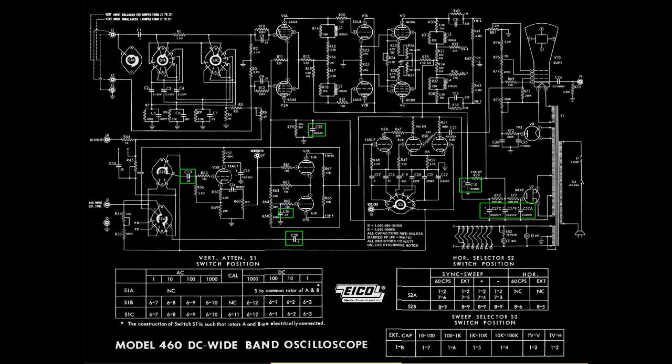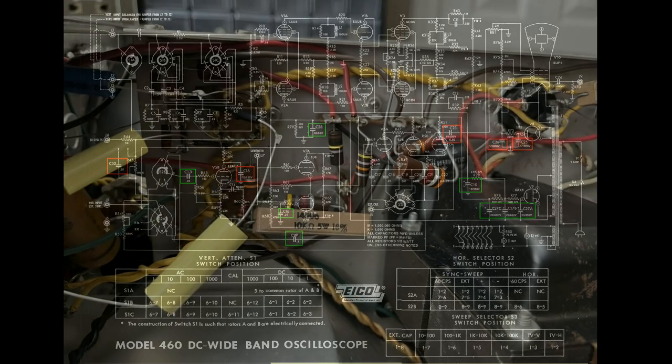So it's fairly apparent that by the time the second batch of capacitors finally arrived from DigiKey, I was in a fairly deep state of confusion. The things circulating in my head at the time were A, there must have been an explosion of the old filter caps, and B, I wasn't sure what else may have been impacted by that event. At the time, it seemed entirely possible that the incident with the filter capacitors could have been a symptom of a larger problem, such as a bad but functioning transformer, or perhaps other components throughout the scope had succumbed in sympathy. These concerns sent me looking for other visible hints of problem.